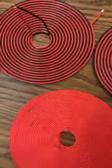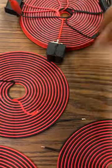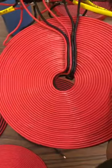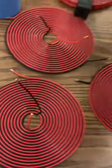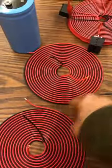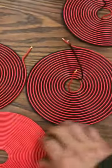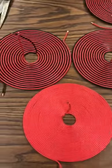So this is what's involved in one of these units. That one there is made of 16 gauge wire, and the original one of these was also made of 16 gauge. I went down to 14 gauge and it increased my output. So I'm building this one in 14 gauge — replicating my original now in 14 gauge to see if I will gain more amperage. I suspect I will.